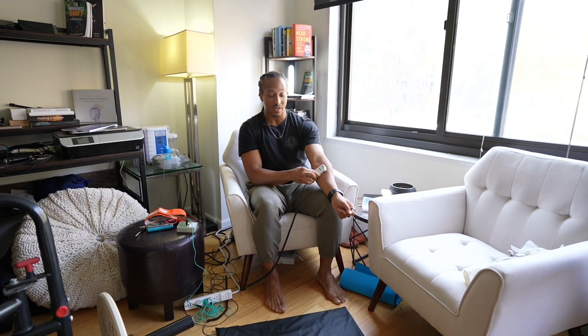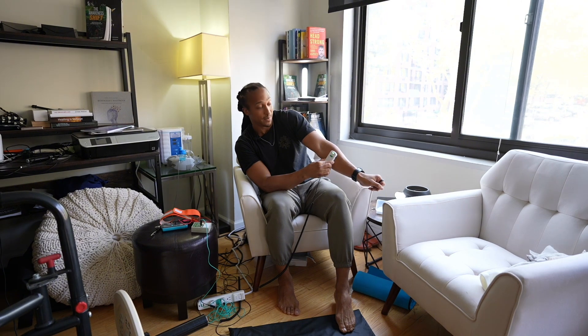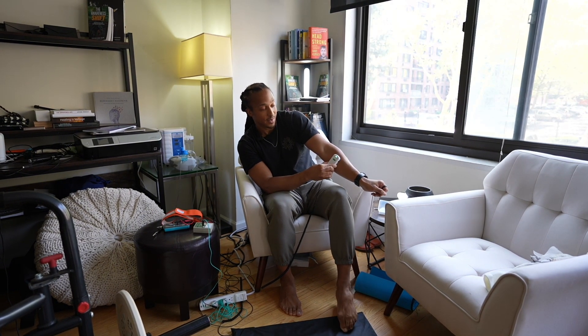This is a great tool to confirm that a material is conductive — whether you're sleeping on a grounding mat or putting your feet on one while working at home, you're going to be grounded. The next level of testing uses the pure ground test meter. Instead of a small metal watch-battery-style contact, this one has a square metal button. When connected to the grounding port and I press the button, a series of lights appear. High resistance means electrons from the earth are being blocked. Okay or medium resistance means you're getting some grounding. Low resistance means a constant flow of electrons — that's what we want. With my foot off the grounding pad it shows high; when I put my foot on, it drops to low resistance. That's pretty cool.